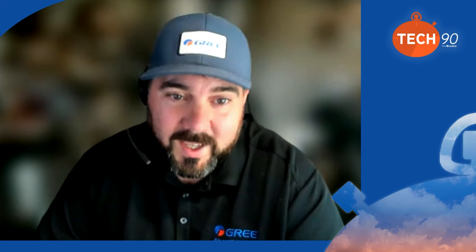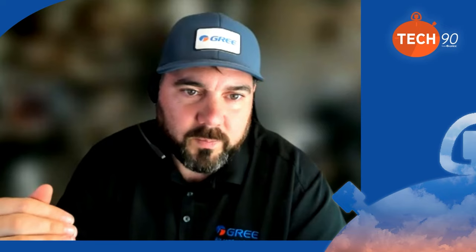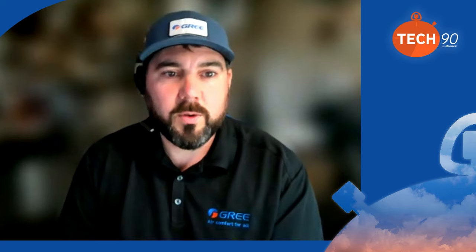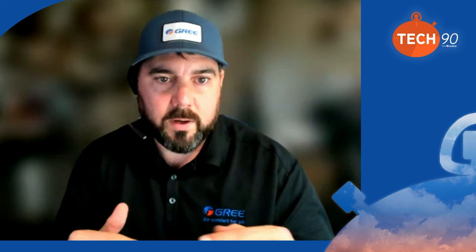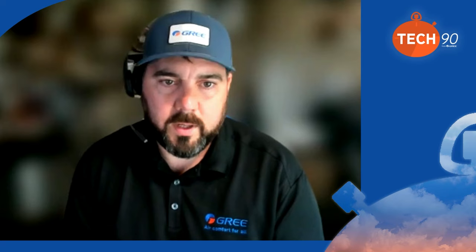You'll get multiples, and we're going to get into it in the next video segment as well. So we're limiting the compressor hertz if we don't have enough airflow, right? Exactly. Then it will go into multiple oil returns, because after the compressor runs for a certain period of time at a lower frequency or speed, it recognizes that it has to ramp up and do this oil return to bring that oil back from the indoor coil so that it continues lubricating the compressor.